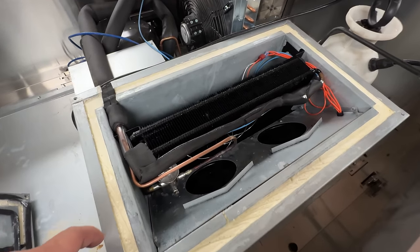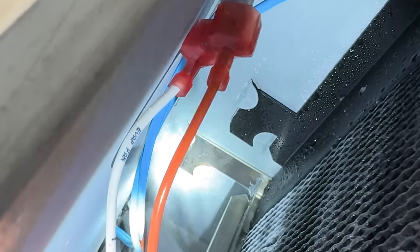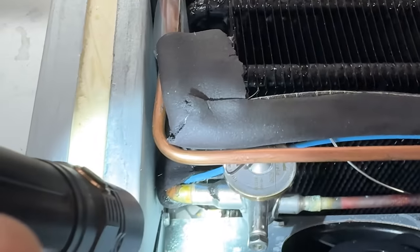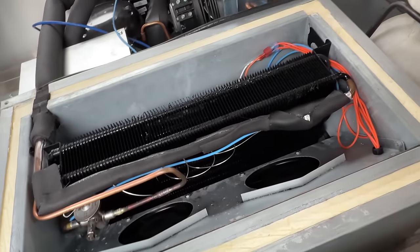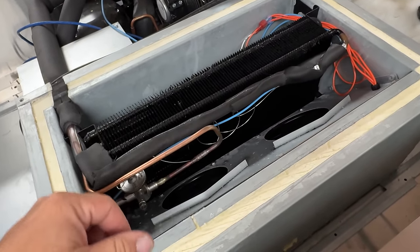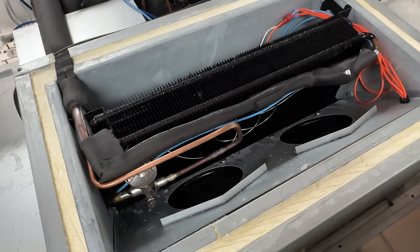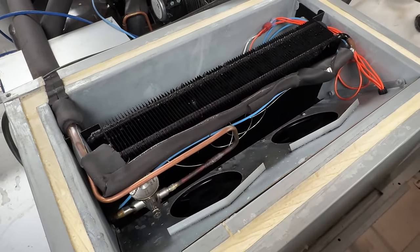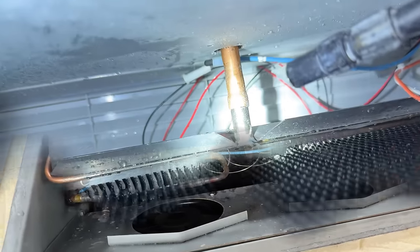Because these defrosts automatically terminate at 41 degrees and there's no option to make that longer to compensate for it, well, we're going to play stupid games here. We'll go ahead and melt that out and get the pan in correctly. If you look down there, there's really no way to get that down any further into that V-shape. I don't know what's going to happen — I guess we're just going to wait around for a while. He said if you want to tap into it go ahead and tap into it. And it's like — what are you going to cover or not cover? What are your diagnostics on how to do this without tapping into it? Do you have temperatures for your evaporator inlet/outlets, what your condensing temperature is over ambient? You don't get none of that information. This was so irritating.